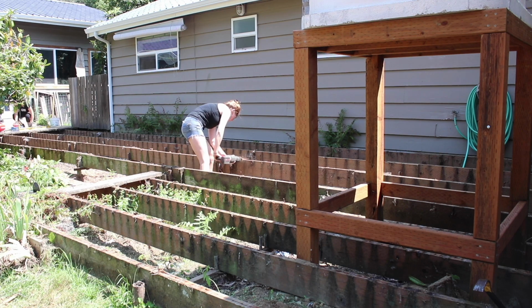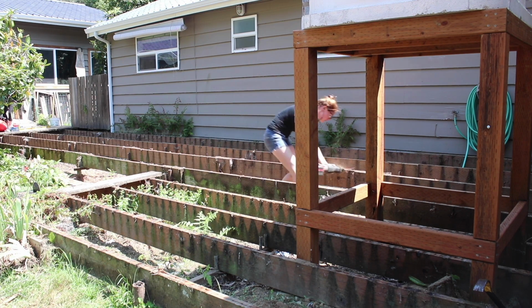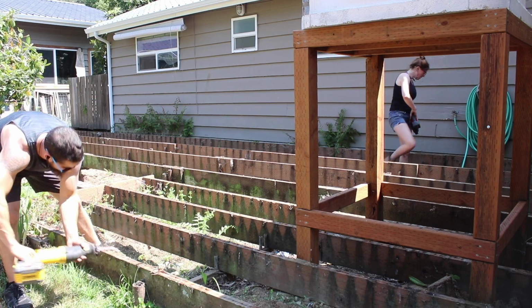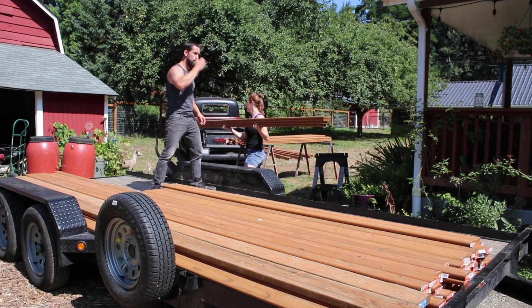After the deck boards were ripped up, we started denailing the joists. Instead of spending a bunch of time with a hammer trying to rip them out, we just went through with a few sawzalls and a demo blade to cut them off flush. With all of the joists cleared, next was to unload the new material that we will be laying down.